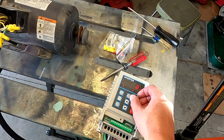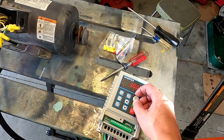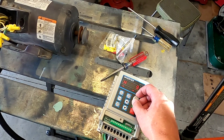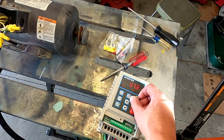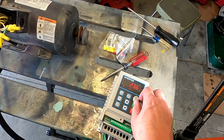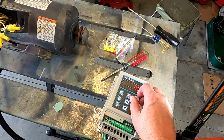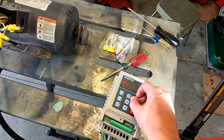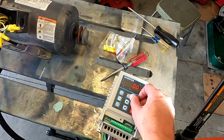Now let's say I was running my band saw here and cutting mild steel and I wanted to cut something a bit harder — I could just turn this down. Same thing on your lathe if you want to turn down your spindle speed. I don't like dropping it below 30. Let's see if she'll do a forward-reverse on the fly — oh yeah, just like that, which might be dangerous on a saw. She runs real smooth at 60. I'll probably set this up to 90.